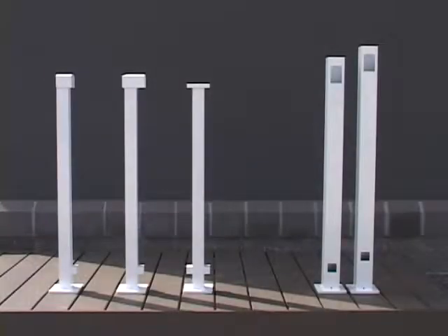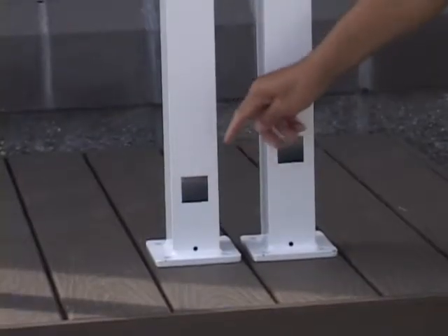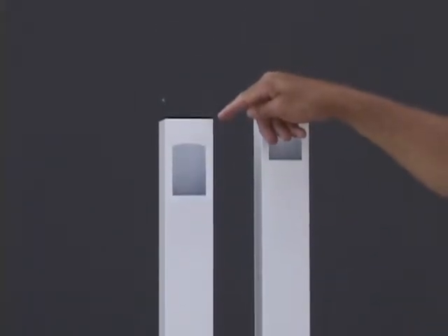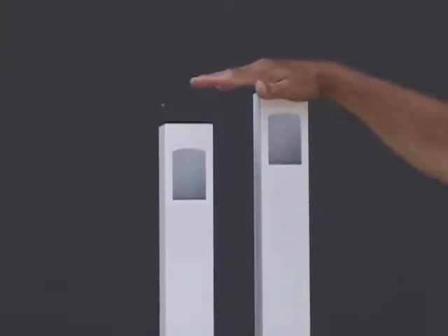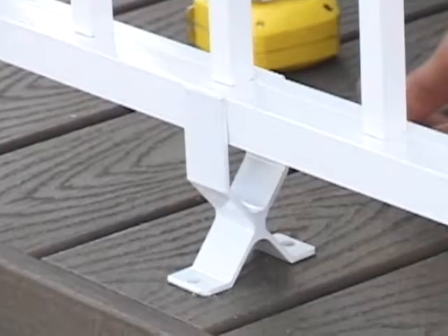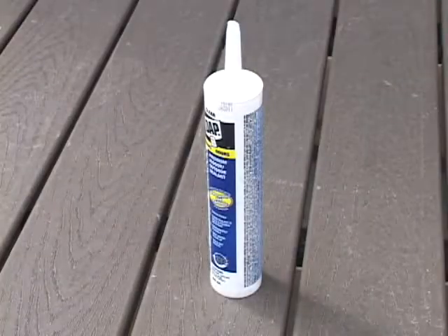For this specific application, we'll be illustrating the usage of an end post, a corner post, and a saddle post to support the deck railing joining into the top stair post with top and bottom sleeves. The stair rail runs between a top and bottom stair post with punch outs in the post face to simplify the installation of the rackable, code compliant stair railing. Please note there is a top and bottom stair post — the top stair post is the shorter of the two. Also install bottom rail support legs to prevent the bottom rail from sagging. Other items you may require include exterior grade silicone to secure your post caps firmly into place on applications with stair posts.